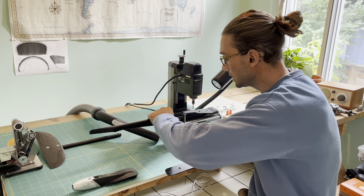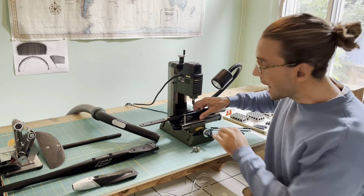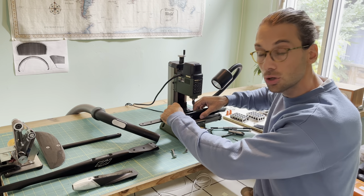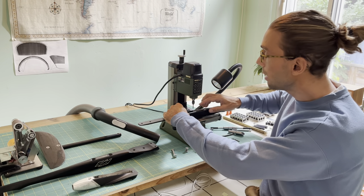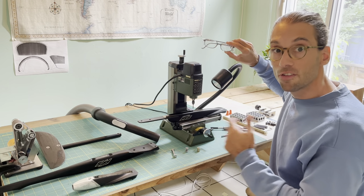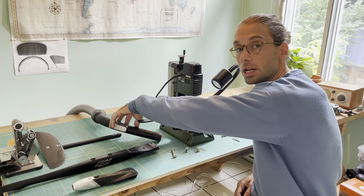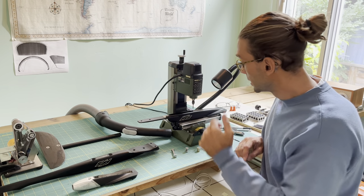Now we can mount the fuselage in this direction onto the plate using the same approach, but with shorter bolts that directly bolt into the existing holes. Make sure your fuselage is well aligned with the working plate before you start milling. Always wear safety glasses because this sends a lot of aluminum flying, and also ear protection because it can get loud.